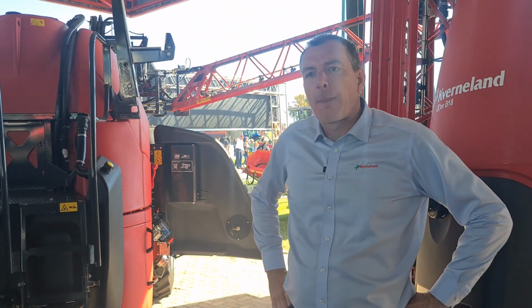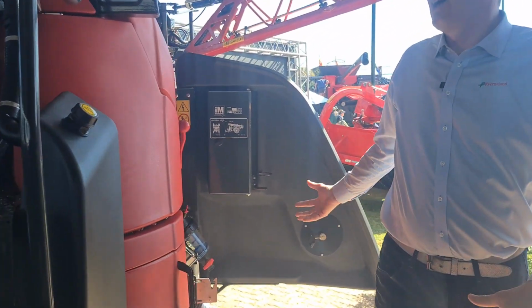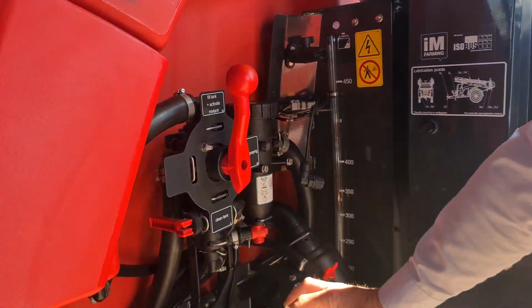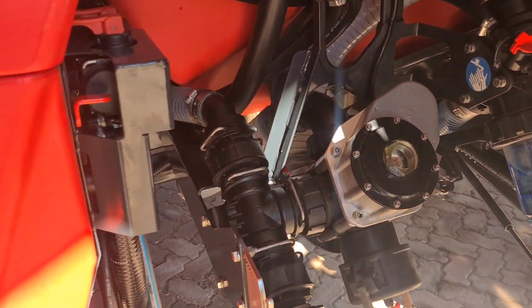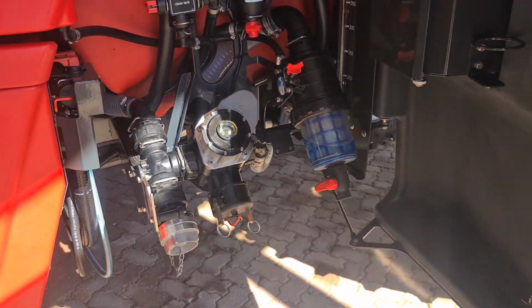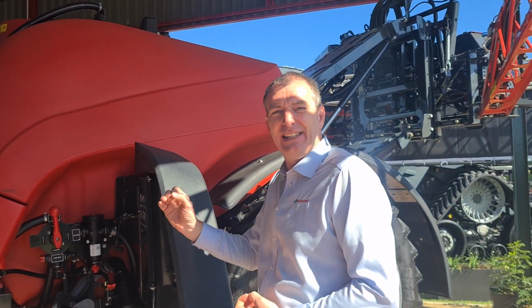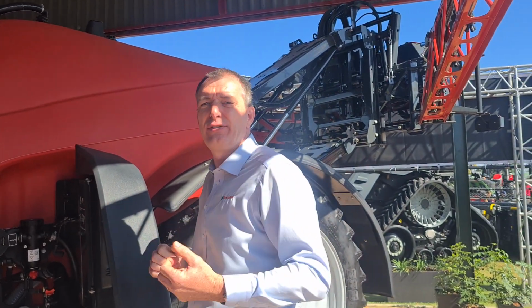Yeah. Then we get to these things, which is a lot more. They've got your precision spraying and can do overlapping and all of those. But also already at operation here at the filling, the operation center, we already put an electric valve in. Yes. So when filling, you can enter the number of hectares. The computer already knows how much liter per hectare you want to do, and it fills exactly the liters that you need for those hectares.